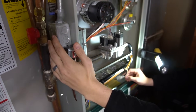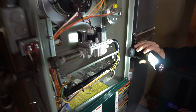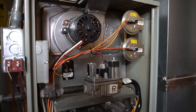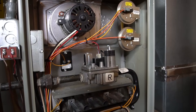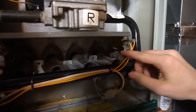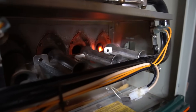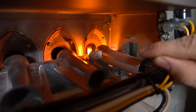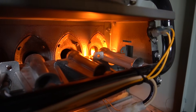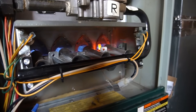If I plug it back in and reset my furnace power, we'll now be able to see what a normal sequence of operation looks like. So once again the inducer motor comes on. This time I have it plugged in all the way — and there goes my hot surface igniter. As you can see, it's glowing bright orange like that. Gas valve opens up and there go my burners.